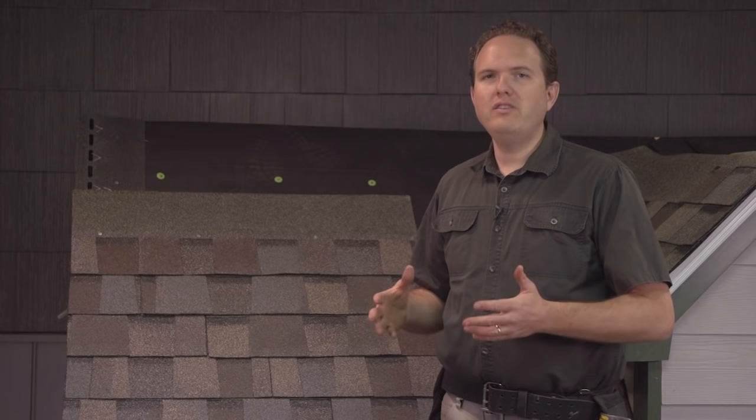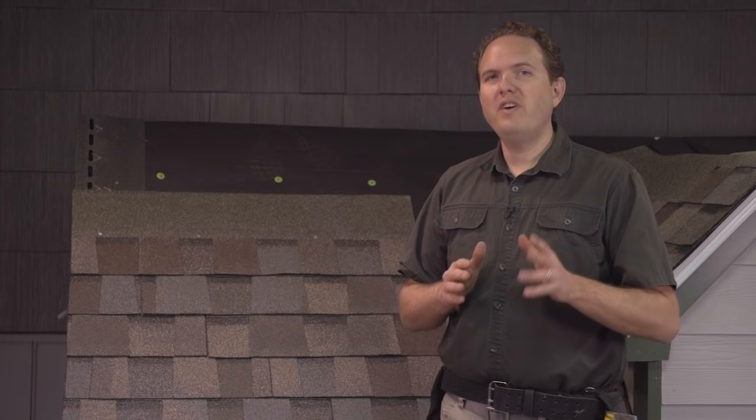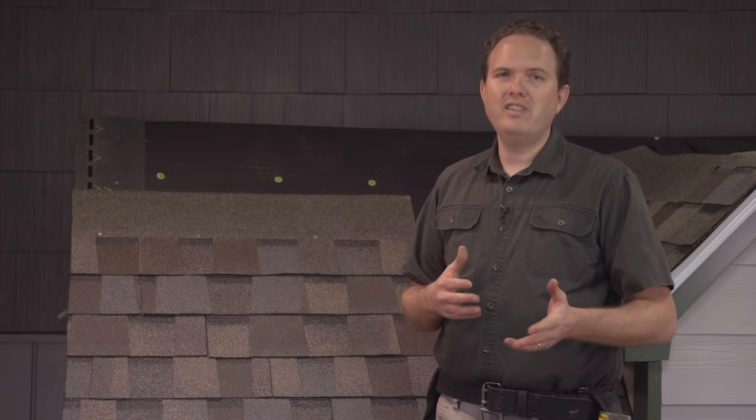If you can't do that, here's my advice: get new shingles that match the color of the shingles as they look now, not necessarily their original color. For example, if your roof was originally a charcoal black type shingle but now it's ten years later and those shingles are actually looking a lot more light gray, a new charcoal shingle replacement is really going to stand out — a really dark black shingle against the lighter gray shingles. My advice is to find a shingle color that more closely matches the actual color of the roof as it looks today, rather than trying to match how it looked ten years ago.